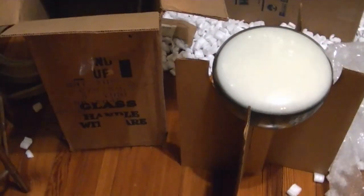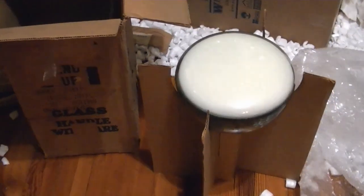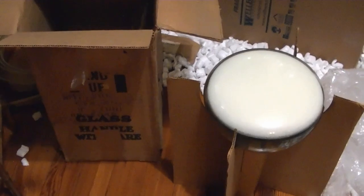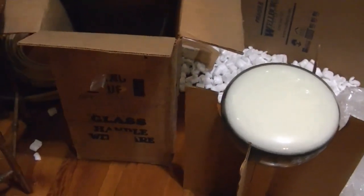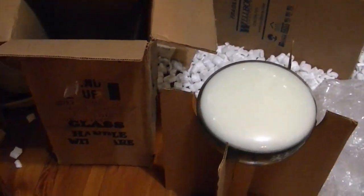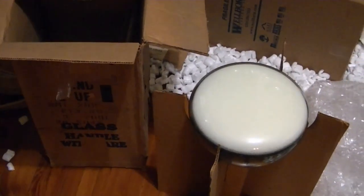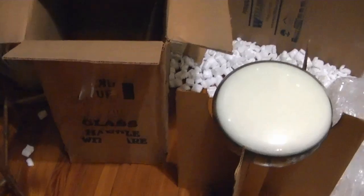And actually a lot of CRTs, especially the smaller ones, are supposed to be shipped with the face up. Typically scope CRTs, electrostatic ones. The reason for that is if any of the elements break loose or a little bit of debris breaks loose inside, it won't scratch up the phosphor. When the picture tubes got larger and larger, they're so much heavier in the front, they switched to shipping them with the face down, I believe.